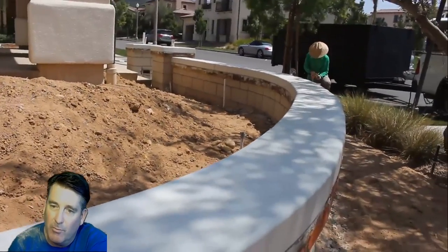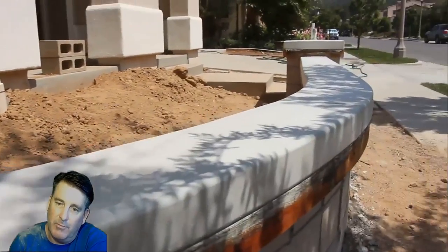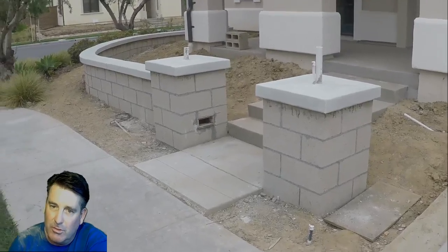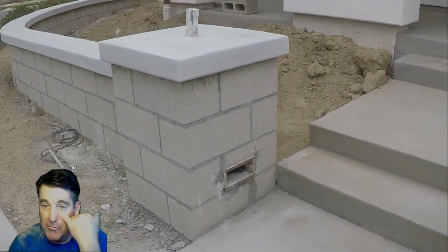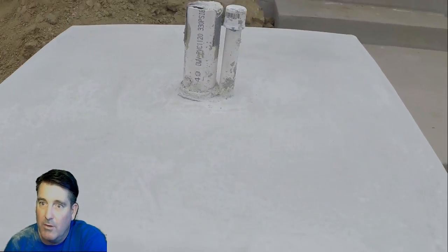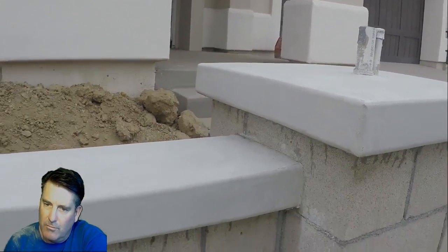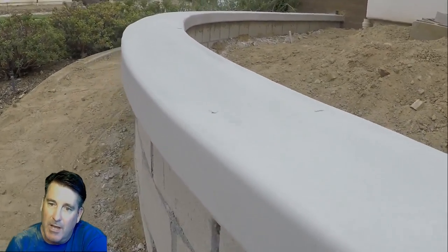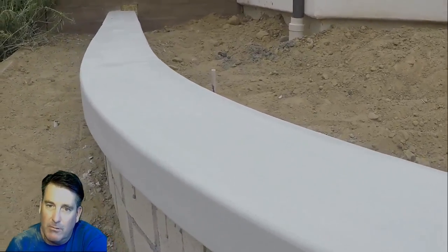When removing the forms, it's important to pull the screws and instead of pulling the form outwards, pull it downwards. If you pull outward and the forms weren't flush, you can knock a chunk of the face off — so just drop them straight down. This is the next day; we just stripped it out and it looks pretty good, drying out real nice. I needed that notch-out space to work the top of the lower cap. This is the half-inch radius all the way around — top and bottom, joints and depth of joints. Easy one to remember: half-inch everything.